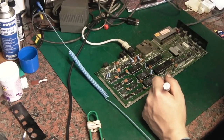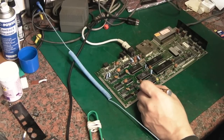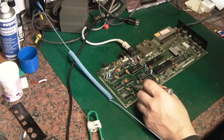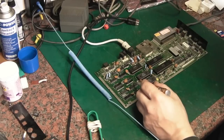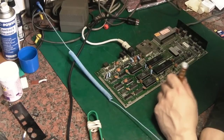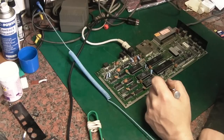Yeah, that. In fact, I wonder if, because I might actually be able to just stick 64s in there, 4164s in there instead. Actually, being that all that's the difference is there's a few extra address lines which just won't be used. I think it would actually function. Have I got any tested ones I could try? That's a wonder. Right, well, I think I'm going to leave this video here for now.